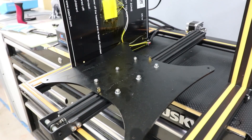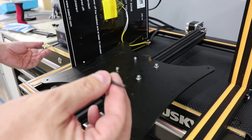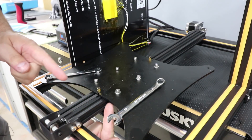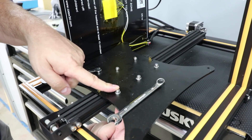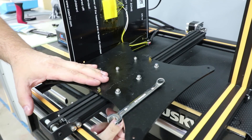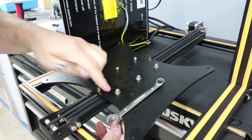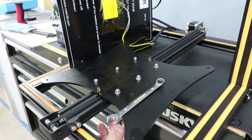I've moved the printer to the edge of the workbench. I'm pretty sure this is a two and a half or a three millimeter Allen wrench. That's an eight millimeter open box wrench, and this is a 10 millimeter eccentric nut. The screw actually goes through the eccentric nut, up past the washer, into the lock nut. All you have to do is take your Allen wrench, put it through the bottom into the actual screw itself, take your eight millimeter wrench, and just snug it down. If you want to add Loctite that's up to you — although these are a pretty decent size screw so it shouldn't hurt anything.